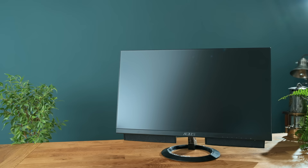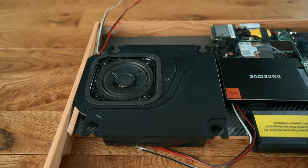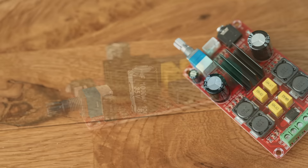These units were glued to the monitor at a downwards angle to project the sound waves underneath and forwards towards the listener. These look reasonably presentable from the front and should provide excellent clarity. The subwoofer can be mounted in the rear casing, as bass frequencies pass around objects more easily. With these speakers being pretty powerful, an amplifier needed to be used. In my case, a stereo one was just fine because the speaker drivers themselves have crossover filters built in, as well as a mono mix for the subwoofer.